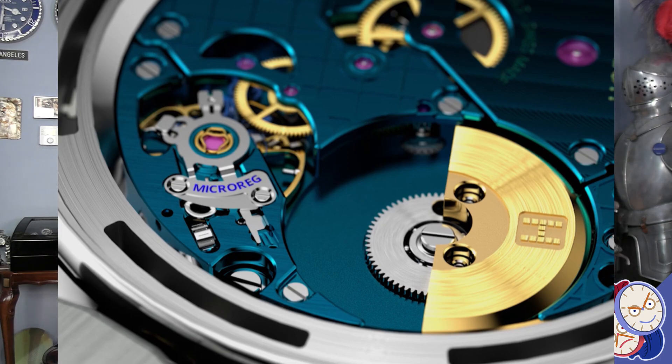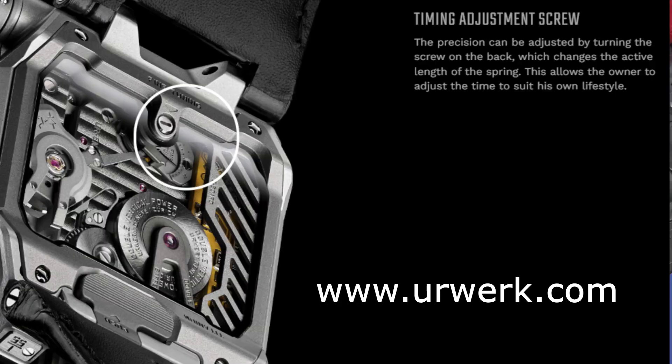Before I go into the details, I will point out that Urwerk did something similar. The Urwerk version of it, the EMC — the Urwerk EMC — is very similar to the Horage in that electronically you can track the beat rate. In the case of the Horage, the mechanism to adjust the balance is also electronic, with a micro motor inside the movement attached to the balance. It had an external adjustment screw so you could regulate your watch without opening the case. The Urwerk EMC was actually the first to have self-regulation without having to open the case.